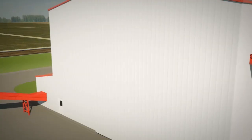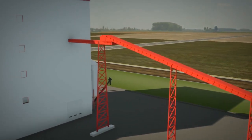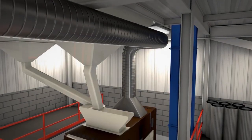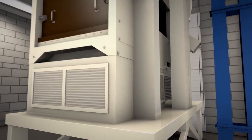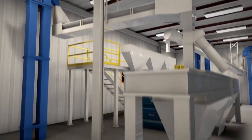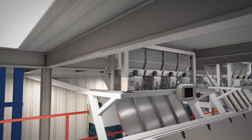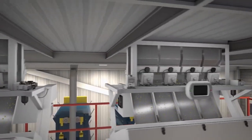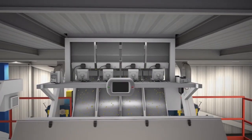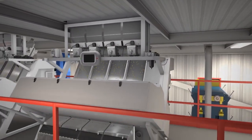The shelled seed corn is temporarily stored in bulk where it is aerated to stabilize temperature and moisture. Then it is transferred to the air and screen cleaners, which are used to remove stray husk particles, beeswings and other foreign materials. Color sorters are machines that can detect abnormal or discolored seeds. They quickly determine if a seed is defective and blow it into the discard stream. Good seed continues on to the sizers.